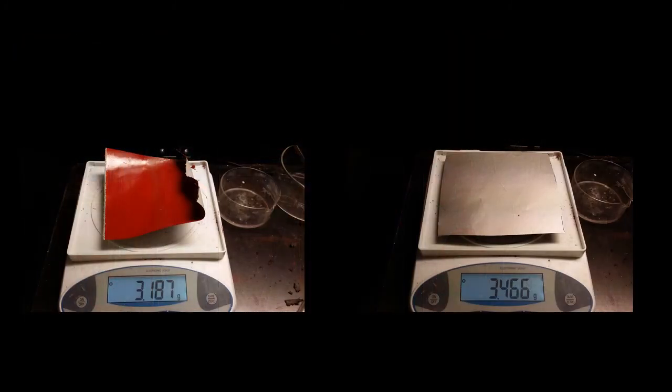Now here's one of the downsides. Oratex advertises that their fabric is considerably lighter than existing or conventional fabrics. And I found this not to be the case. In fact, my aircraft gained about 40 pounds using Oratex. Now, I also used paint. I put a bit of paint on it, as you'll see in the last pictures. And I did put a third seat in the back.